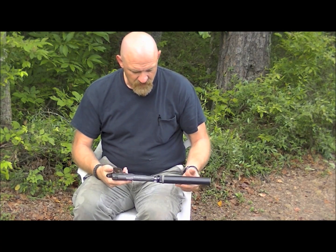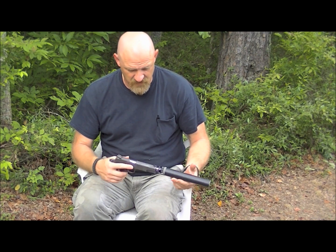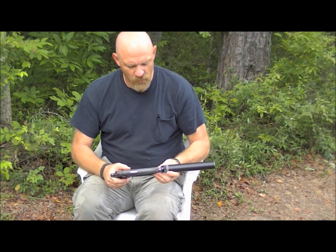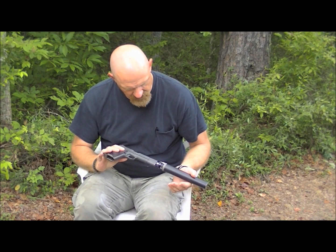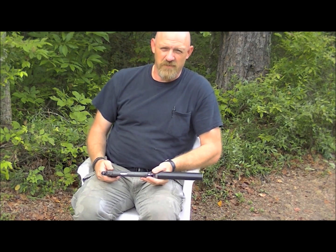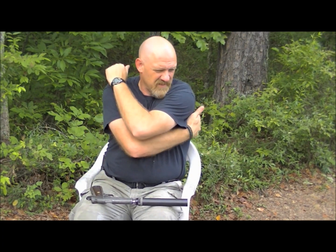You decouple the barrel from the silencer by putting the piston inside the housing and allowing it to free-flow, and the spring does nothing more than return it to battery for consistent operation. That's all there is to it. That was a great innovation in silencer design, as it allowed virtually anybody's silencer to be used on anybody's handgun. We're going to put this 1911 back together, get everything back in order, and get back to work making silencers for you.